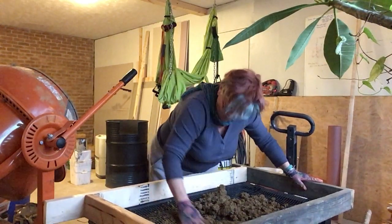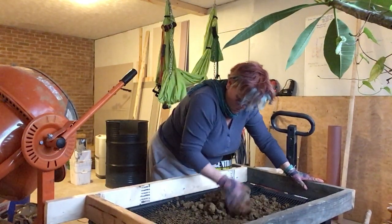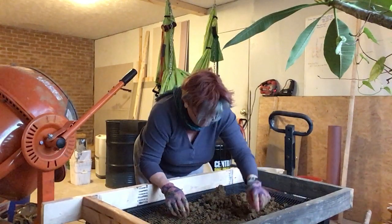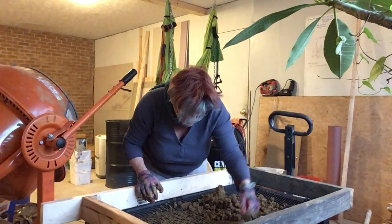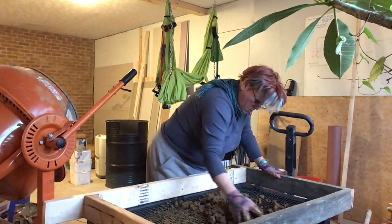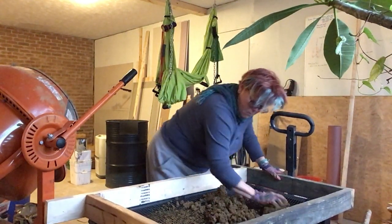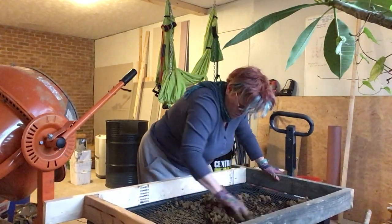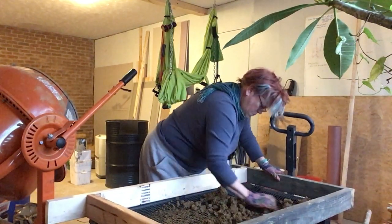And there's sort of a narrow window of operation there and a broad range of failure, I guess is how I'll say it. They require things to be balanced just right, because you have to keep that coil under boiling by running fluid through it fast enough that it's cool enough to keep it at that temperature, and where in the system it is, all those things are variables.